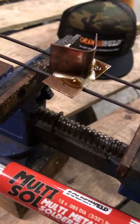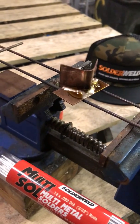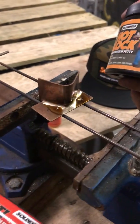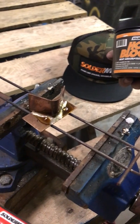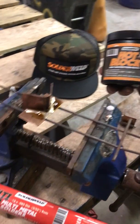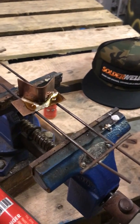You won't have to worry about impurities getting into the oil, impurities getting inside the screen to the TXV, or plugging up the dryers. This is just a really fabulous product. And if you put this together with the hot block — you've got a solder-weld product that does an amazing job. If you had fiberglass, electrical wiring, or an EEV — an electronic expansion valve — with a brass body, the hot block protects all the components. You don't have to worry about overheat. It's just a great complete package application.